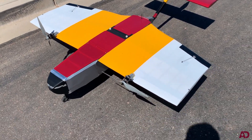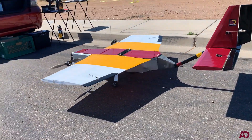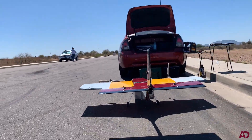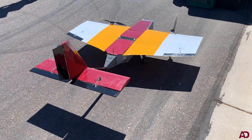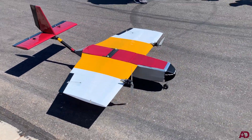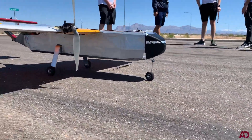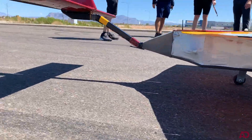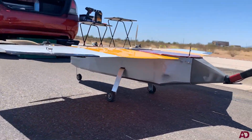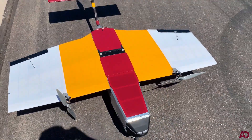Here's a walk around of the finished aircraft. You can see the low aspect ratio wing dominating most of the fuselage. High mounted tail to avoid strikes with the sensor. 3D printed end cap and nose cap. Two doors on the top that flip up for ease of access in the ground mission. Here you can see the varied camber across the span of the wing. Custom landing gear. 3D printed tail joint. Bolts hold everything together. Large propellers. And that's our aircraft.